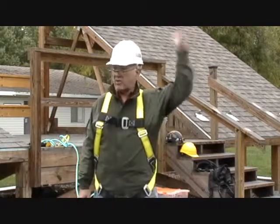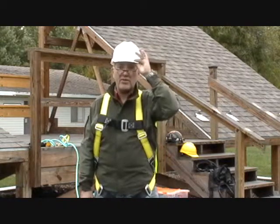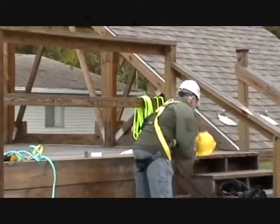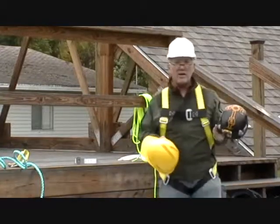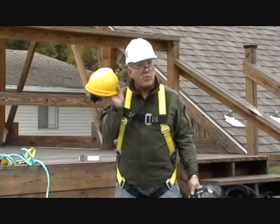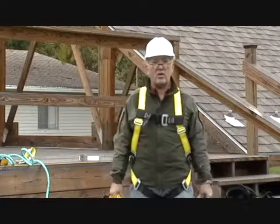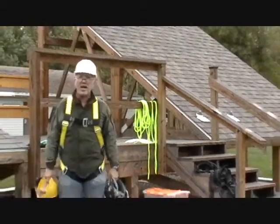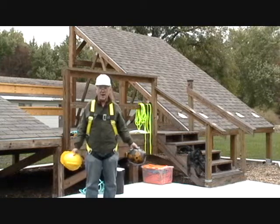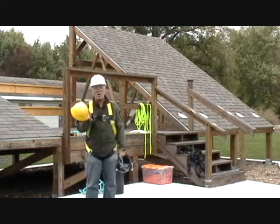Let's start with a discussion right here on the top of the head. I have on a construction grade approved hardhat. I want to point out the difference between this and a few others behind me. Here are two other styles of hardhat or helmet. Notice the difference in color: nice bright white-yellow versus dark black. Why would color be significant? If we are putting photovoltaic arrays on roofs, in the summertime it's going to be hot. To avoid problems due to overheating, especially in the head area, we want to avoid dark colors - go with light colors.